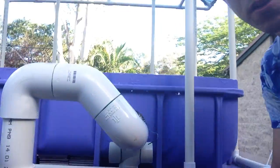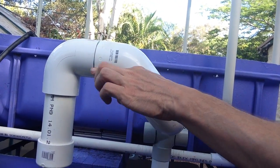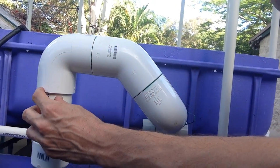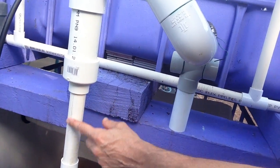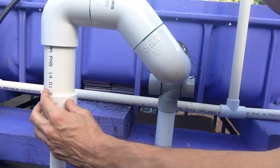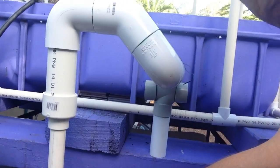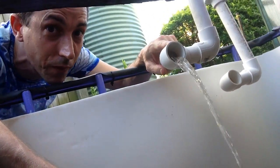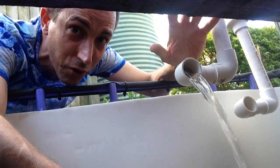What's happening is the air has to be dragged out of here. As the water rises to the height of the water at the moment, it starts to spill over and go through. As the water spills down here — this is a 50mm to 25mm reducer, so this is a 25mm pipe going down — it's basically sucking all the air from up here down. As it sucks the air down and out through the bottom, it's replacing the air up here with water. You can see it starting to splutter as it pulls out the air.